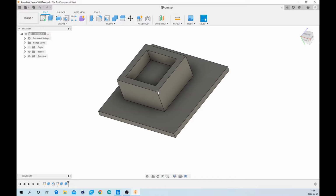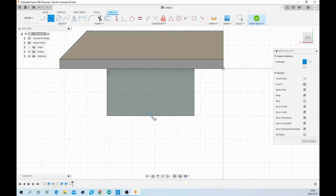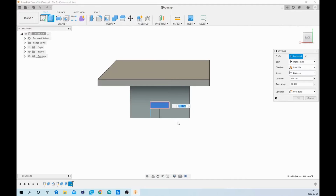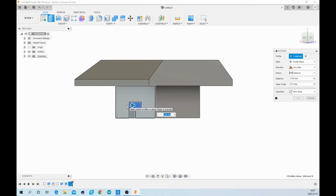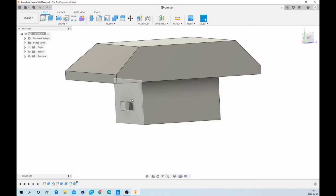So now to the small hooks that will go here on either side and make it so that it can't go out. They're located about 2 millimeters down and are let's say 3 wide. So we'll go right here, make them go maybe 1.5 and make them 3 wide, just like that, and they don't have to be that big. We'll make them 0.5 millimeter about, just like that. Then I'll make one on the other side and maybe put some chamfer on, and then I'll be back.